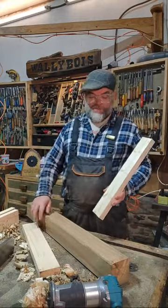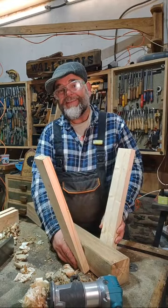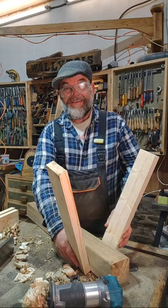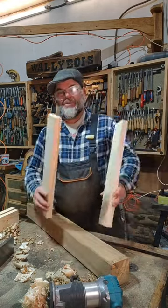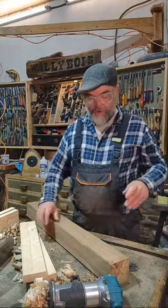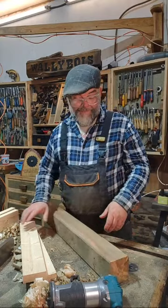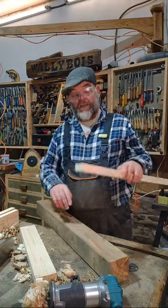But I don't just want a splay. I want a splay of legs like that as well. So which means you've got two angles to deal with, which is a real pain. Now I'm not going to chop one side right in, but the top face will be chopped right back in, or part way. Sometimes, if these are thicker legs, I might have just done a half lap joint